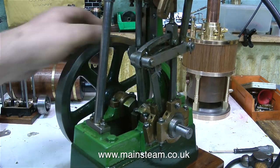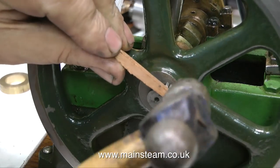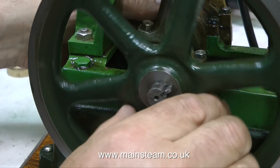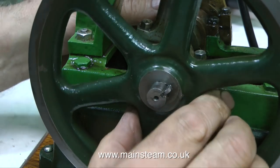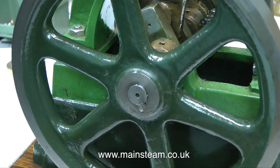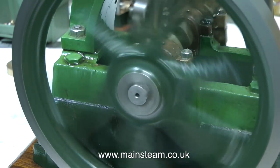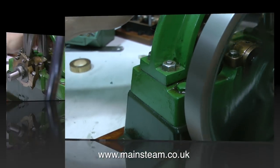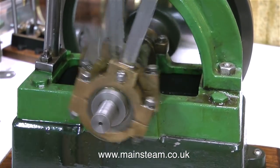Consequently, the engine is not liking going in reverse. In my opinion, a flywheel on a model engine should not stick out too far from the end of the crankshaft, because that's how crankshafts get bent. I tapped this one back a little way and you can see just how slack this key is — it's supposed to be a tight fit in both the crankshaft keyway and the flywheel keyway, so it definitely needs a new key making. I put the flywheel back to the end of the crankshaft as I received it. This video is only an inspection and assessment. Thanks for watching, and I hope you found it useful.